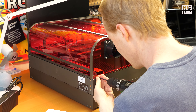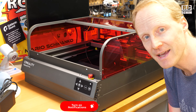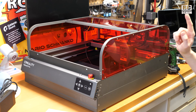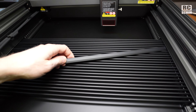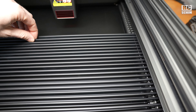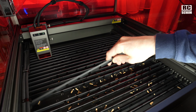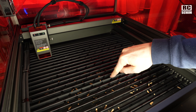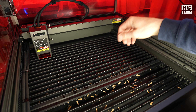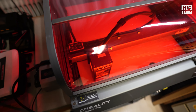It's a lot of reviews on my channel about tech stuff. Normally drones in the not-so-nice season, I get distracted by other things like laser cutters. This thing is a dust magnet, that's for sure. Now this was easy, just a bit tedious. You just place those metal rods. You can also use wider open for larger objects to cover the whole area. But you can also use the flat end up, which minimizes the amount of wear on them. You can also use them in flat mode if you need extra support for really small and brittle stuff that you will engrave. This is the first test calibration sheet, which is rather large — 50 by 50.